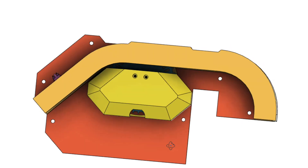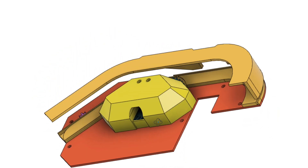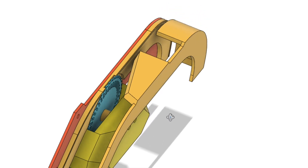So I went back into CAD and started on version 2. This uses a right angle worm gearbox on the N20 motor, and it has some guides on top to help facilitate peeling the film up. I started printing the parts out, and hopefully by the time the circuit boards come in all of them will be ready and I'll have a working finished feeder.